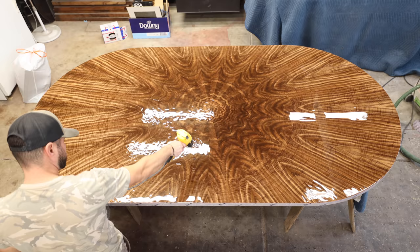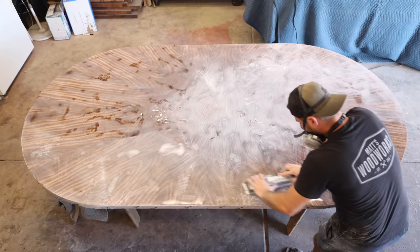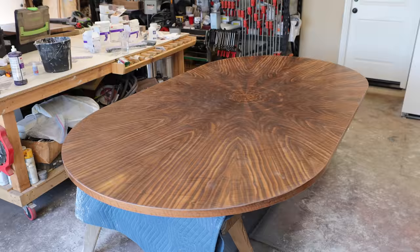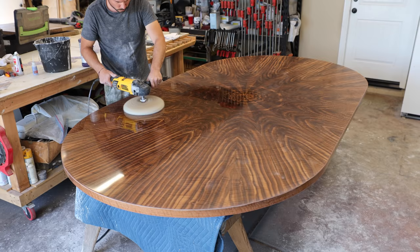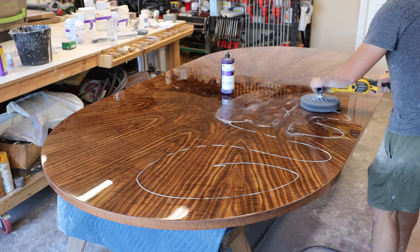Round two — I got all the epoxy going on. I did the pizza sauce method as Cam does at Blacktail. Still wasn't able to get it perfectly flat so I had to re-block sand it after that cured. I had plenty of material to work with so I worked for probably a week going all the way through the grits — this was all getting a high polish as well. Right here it's roughly 3,000 grit and I'm just getting ready to start the polishing process. This is probably the last polishing job I'm going to do for a while because I'm polished out. I've only done one other high-gloss sunburst before — that was for a ping pong table a couple years ago using a different finish — so this is the first time seeing it with epoxy, and it's really cool to see it come to life. It definitely gives you that satisfaction of all the hard work you've been doing over the past month, month and a half.